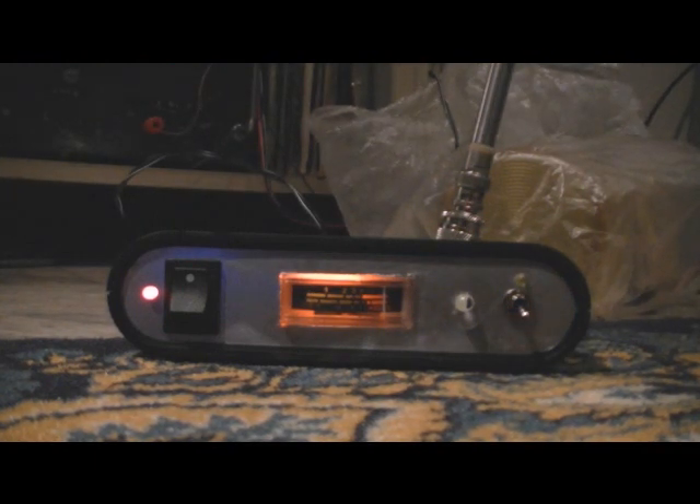The strobe light is off. The meter is just starting to decay now. Hopefully you can see that there. Now we're back into the green area on the meter. Very slowly it will return to zero. And basically this indicates the intensity of the strikes. So if you get a lot of strikes in a very short period of time, the deflection on this meter will be quite great — it will shoot up fairly quickly.